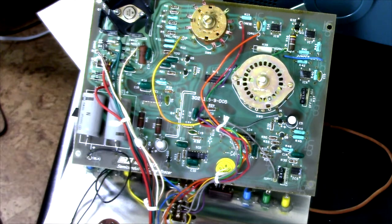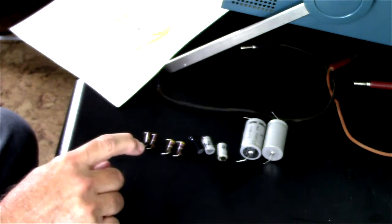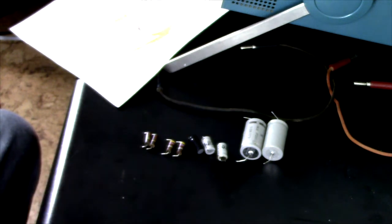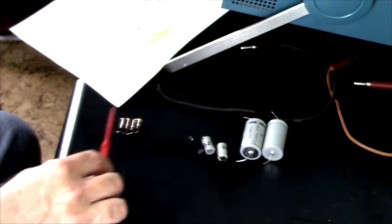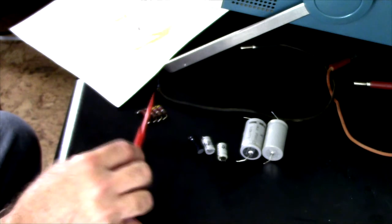Anyway, that's the update from here — hopefully those transistors will arrive shortly and I can get this thing working again. Meanwhile, I'm going to replace some parts. Here are the parts. I haven't done the digital-to-analog converter resistors yet, but these are all the electrolytics and the big resistors. The resistors measure the same outside the circuit as they did inside — three of them are out of spec, and only one is still in spec.